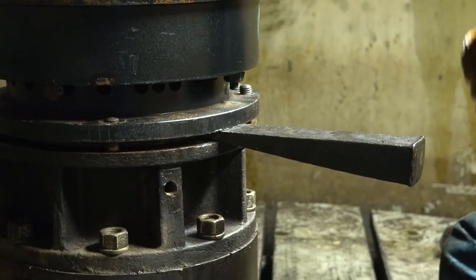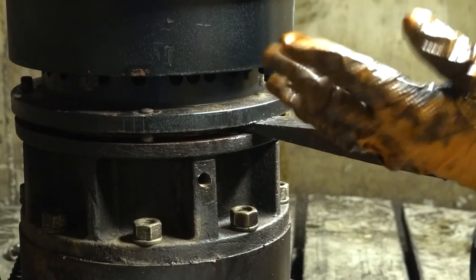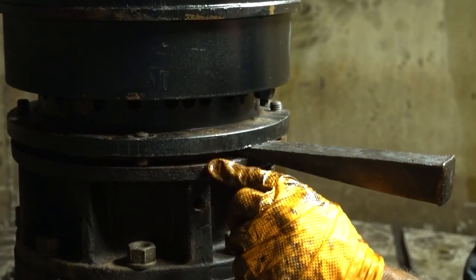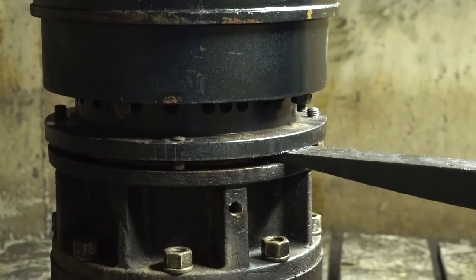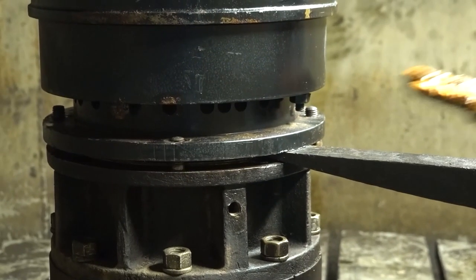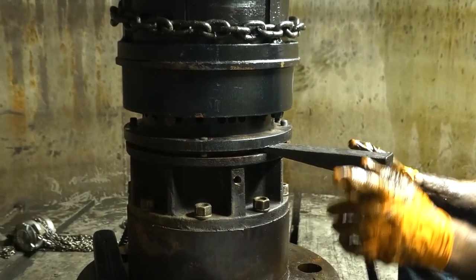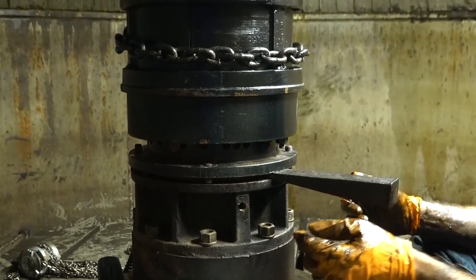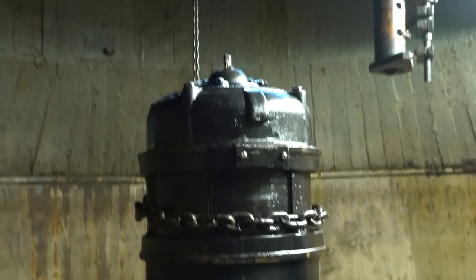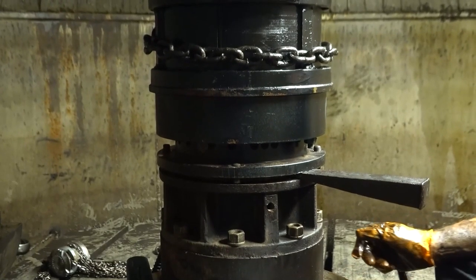So explain to them what you're doing there. There's a machined lip on the inside there. If you get in here, you can see there's a lip in here. And this motor sits on a lip. It's got a gearbox in your motor. That's how everything gets all nice and aligned. But I need this to come up, because I gotta fly it out there to wild beyond. Okay, so we're gonna lift this motor here with chain and stuff, but we gotta break it free from its mount down there. Correct.